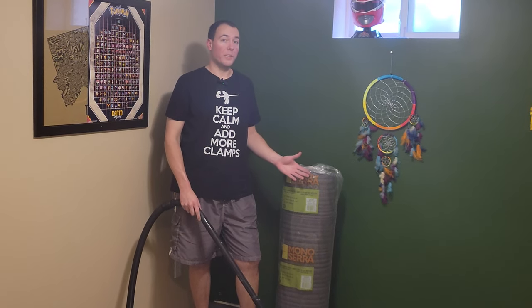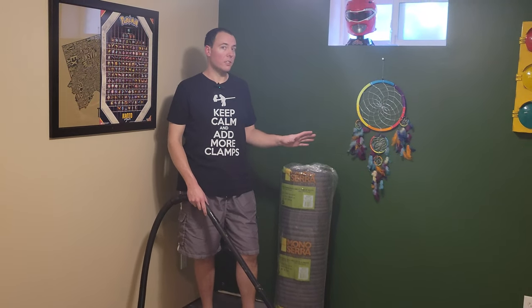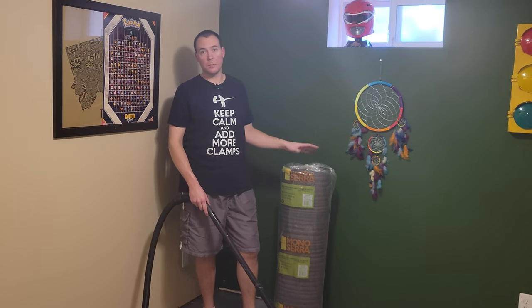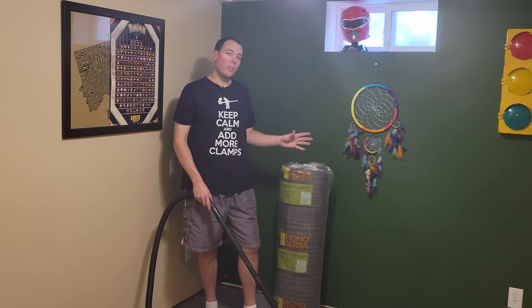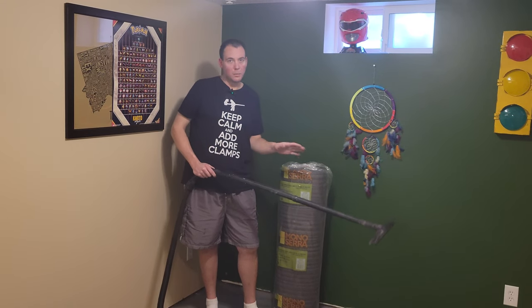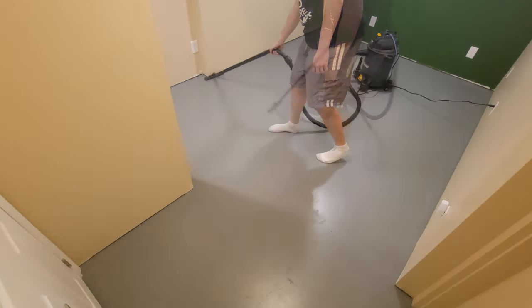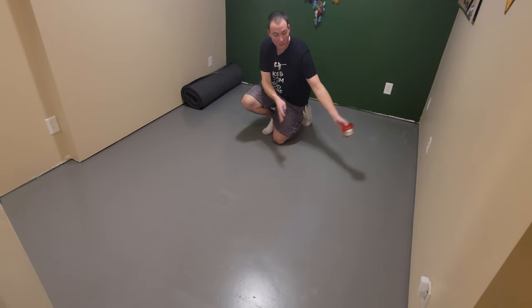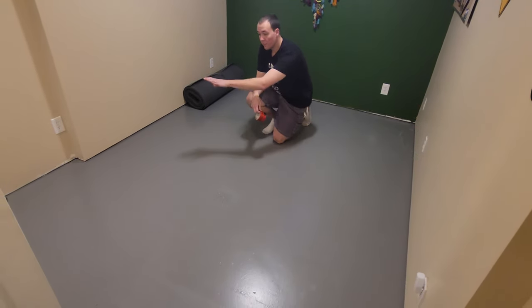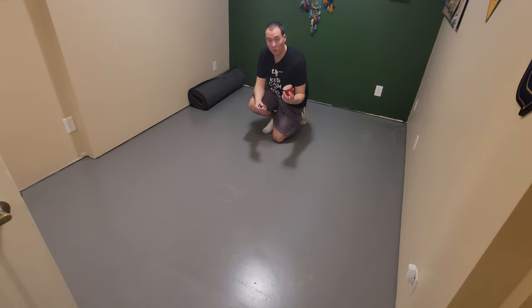The last thing before we can actually start laying laminate is laying down the underlayment. This acts as a vapor barrier as well as a cushion. You can buy lots of different kinds — some have tape built in and some are fancier — but I don't really see a difference, it's just a thin piece of foam. This one doesn't have the tape so I'll tape them together once it's laid down. Just before that I'm going to vacuum the whole room to make sure there are no hidden pebbles, because we don't want a princess-and-the-pea situation. Starting in the corner, rolling it this way, the first pieces are nice square easy cuts; from there the horizontal pieces will have funkier cuts — just lay it out, score it to the wall, and make sure you tape all pieces together.